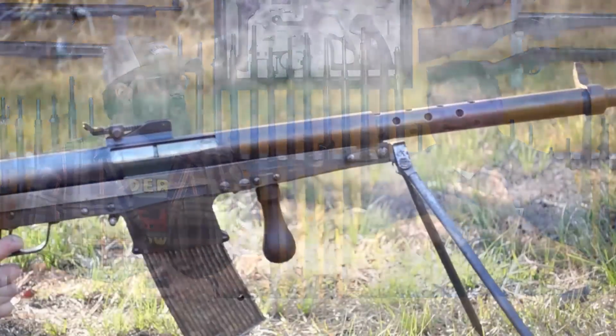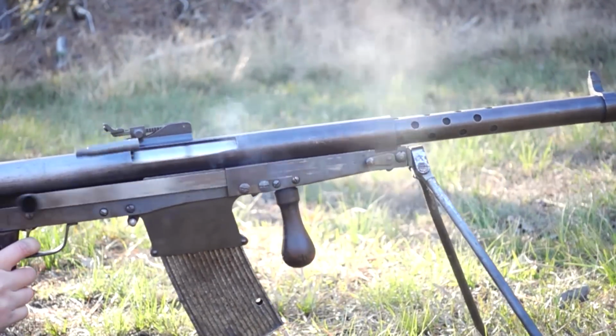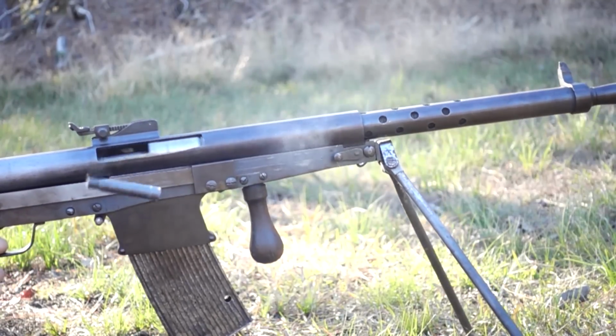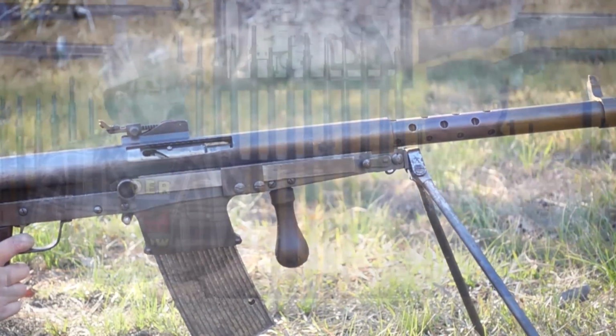So we also mentioned this gun was running steel cased ammo by Ian's request because the 145 grain Wolf was just running. It ran great. And I'm telling you, it obturated cleanly. I didn't find any of the cases that came out that had any streaks down them. There's no lacquer on the outside of these. They're pretty much dry, and they're a lot thinner than some of the Soviet era steel case ammo. So they obturated completely. No burn marks down the sides, complete gas seal in the back. They came out clean. All the chambers look good.